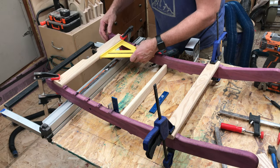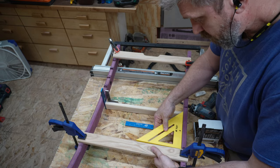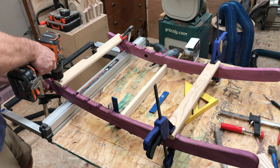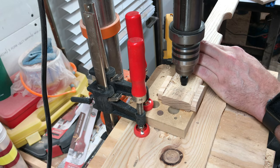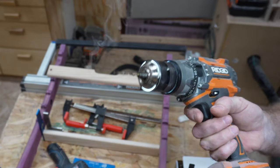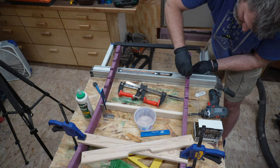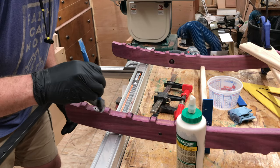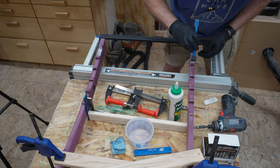Assembly is incredibly easy because the templates for the sides give you the exact placement for all the parts. We'll start with the back support — clamping the lowest slat in place, making sure to leave a quarter inch overhang on both sides. Then the second to last slat on the top can be installed by drilling pilot holes to prevent splitting and securing with a single screw per slat. Since I'm going to be plugging these screw holes, I wanted them all to be at a consistent depth, so I drilled my slats on the drill press first. As with many exotic woods, purple heart is more oily than most domestic hardwoods — that's what gives it that rich purple color — and that oil can interfere with glue adhesion, so it's a good idea to clean away the oil from any gluing surface with acetone. I'm adding just a bit of glue before screwing; you don't want to go crazy on the glue here because squeeze out will be a pain, and any glue that doesn't get cleaned up will show up in an ugly way when it comes time to apply finish.